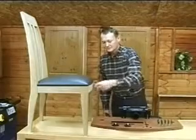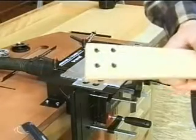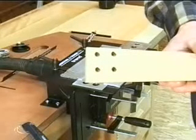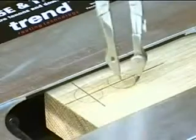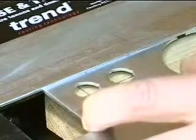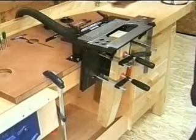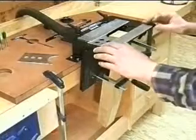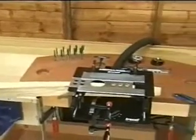To show the full capability of the jig, we've opted to show how to create dowel joints. A good point to remember is that in some situations, when a large amount of timber has been removed, a dowel joint will decrease further removal of timber, thereby resulting in a stronger joint. To improve your accuracy, once you've marked one centre line, use a compass to draw a circle on the first intersection — this will aid precise positioning of the dowel template. Machine using the 5/8ths guide bush. For the front rail dowels, cant the front plate to minus 9 degrees and reposition the dowel template to the correct marked position. The final joint is a series of dowels on the top rail. Clamp the leg in position and line up the long sliding template to machine 3 in-line dowels.